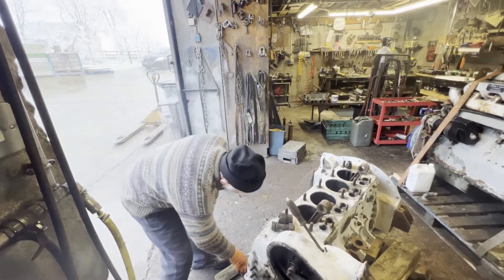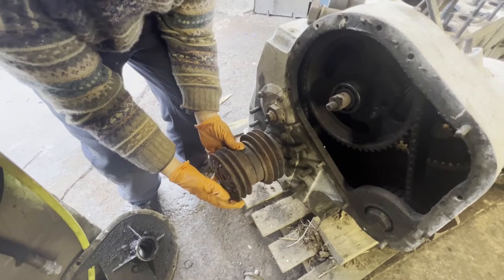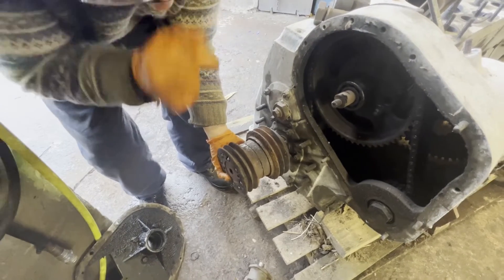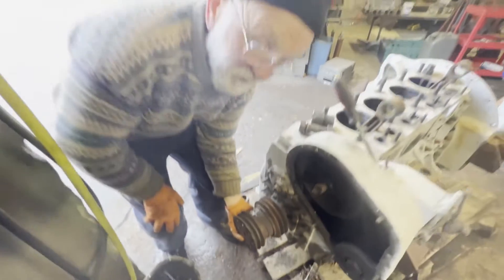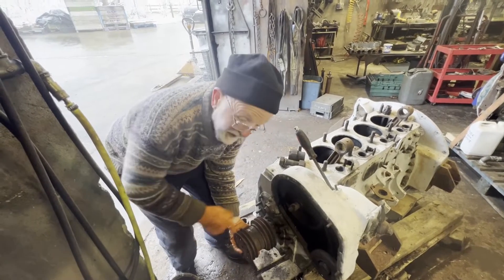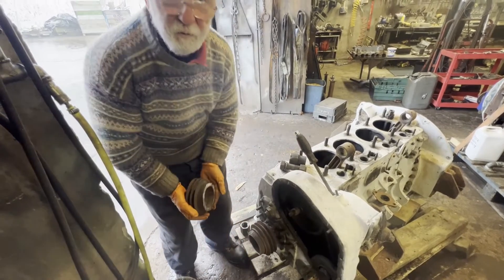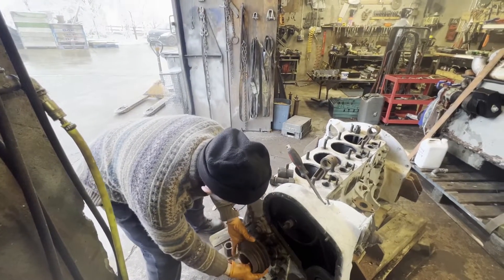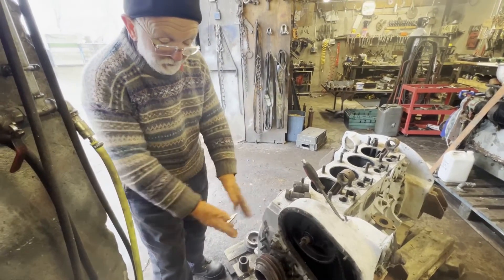Also on this engine, it had what appeared to be an extended crankshaft. At first I made the assumption that the crankshaft itself carried all the way through here, but after much drilling and trying to make presses and pullers and all sorts of things — maybe after half a day's work — we just gave up. We put feelers down in here and concluded that in fact the shaft didn't come the whole way through. So we got our big friendly angle grinder and cut all the way around here and took that off. Once we did that, it was just the same as any automotive engine — there was a big nut in here which came off, no problem, with the proper airline and proper tools. And we were able then to pull the whole lot off.